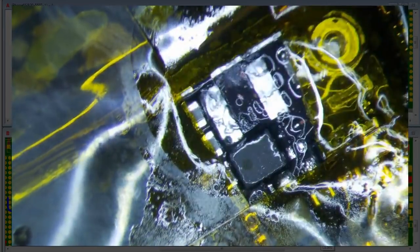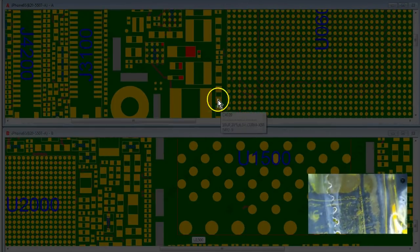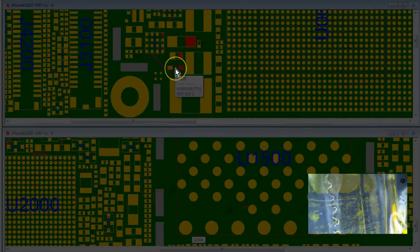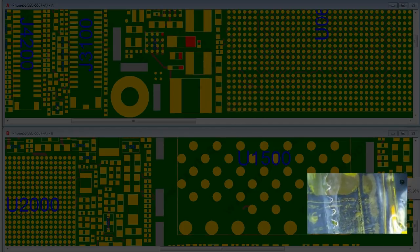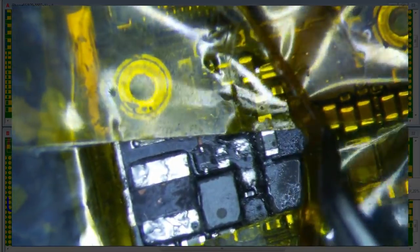Alright, we're good. So, I'll be back. Alright, so it's a go. So we're going to replace the coil, the 30 volt diode, glass diode, and the big cap. And we should be back in business after that. Okay, so first things first, let's move this over a little bit so that we can get access to all this stuff. And then we will get moving on things.